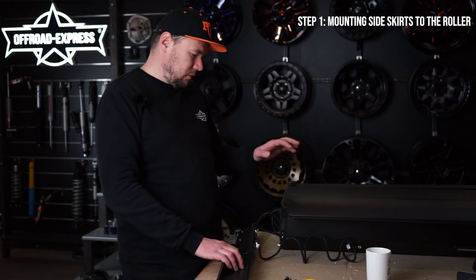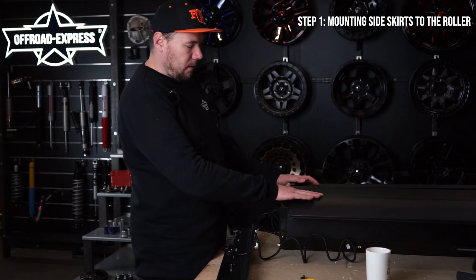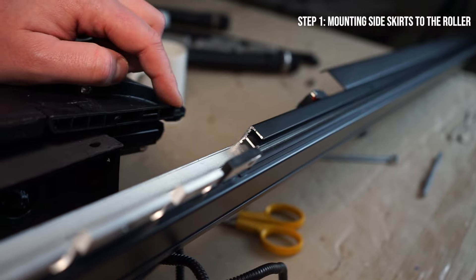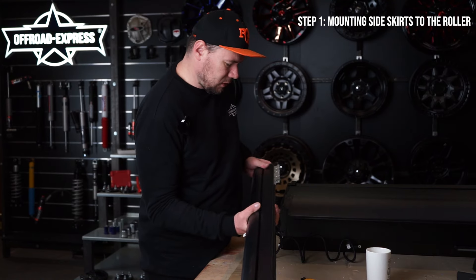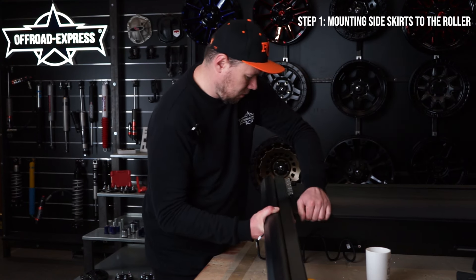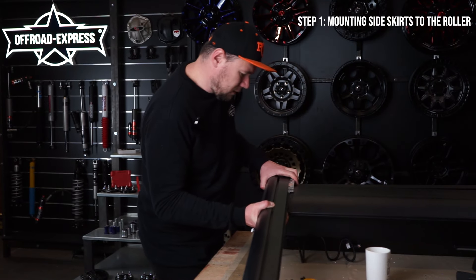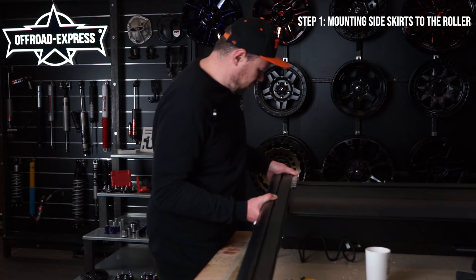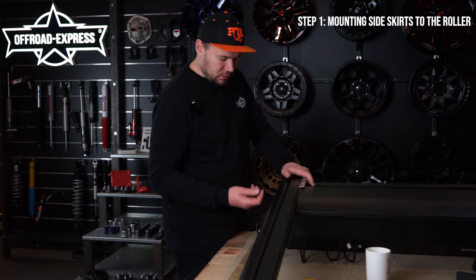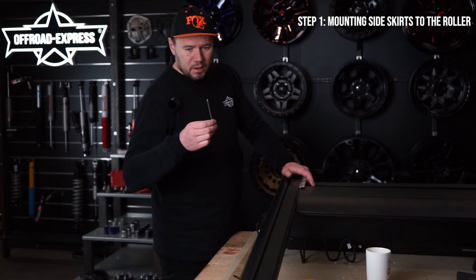Now install the rail to the case box using those three Allen key bolts. Before you do that, make sure the shutter is open enough so you can introduce this part to the actual rail. Do that on an angle — about 30 degrees is the best position for it to enter — while holding the sensor switch with one hand. You can have a friend help you raise it to the right level. Push it forward, then slide that little notch on the back into place. All done — fetch those three bolts from underneath and tighten with a 4mm Allen key. The ball-end makes things much easier.